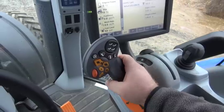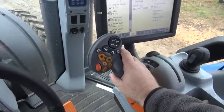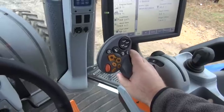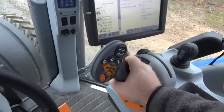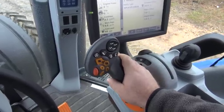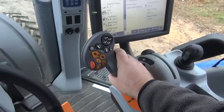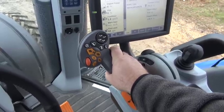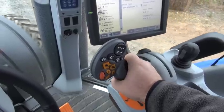A third way to shuttle this tractor is simply by moving the Command Grip forward or backward. While we are talking about moving the Command Grip, let's look at the innovative New Holland feature of force-based movement. Force-based movement means the farther you push the Command Grip, the faster you will go. Letting go of the Command Grip while accelerating will hold you at the speed when you stop pushing forward. Pulling back on the Command Grip will slow you down and eventually bring you to a stop.